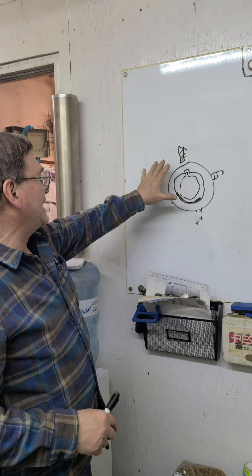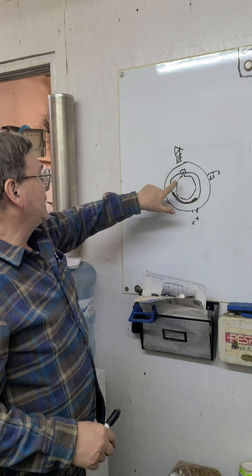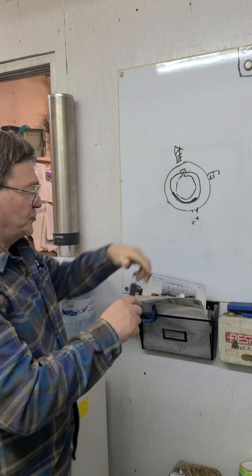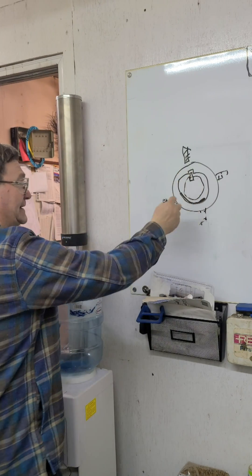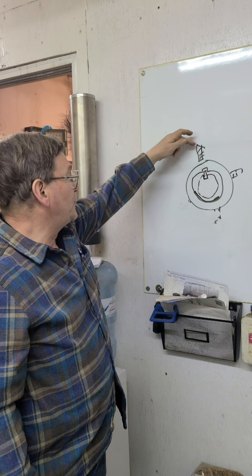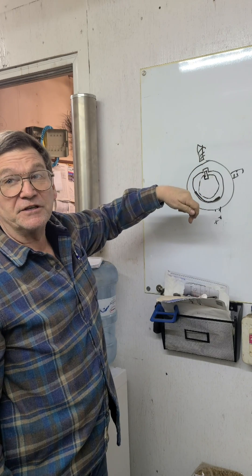Sometimes you're pushing over to one side and this keeps everything tight. The reason you put a set screw over the keyway is because the end of the shaft has a keyway cut in it, and that keyway will want to move out. You push the shaft over in that keyway — you're putting one over the keyway to hold the key itself in.